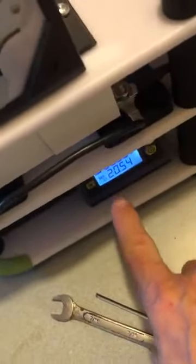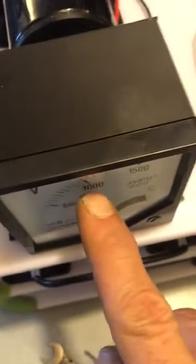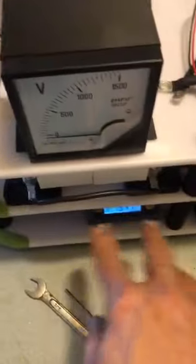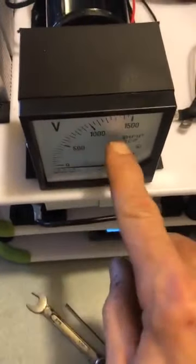When you first energize this device, this capacitor is empty, all these capacitors are empty, and your output capacitor is empty. So in the first action, if you have this set to maximum power — like if you're using 600 volt dumping and you have them set for 1000 volts — whatever voltage it takes to pump your cap here full to 1000 volts, then you're going to minus 600 here, the differential between the two in the settings, and you're going to end up with 400 volts in this big cap. So you set your thing to the running voltage of 1000 volts and adjust this. He will dump but will not go to 1000 volts right off the start — what happens is it compounds here and it compounds here.